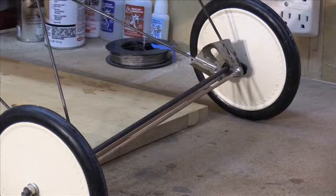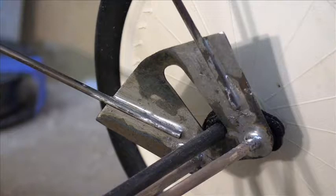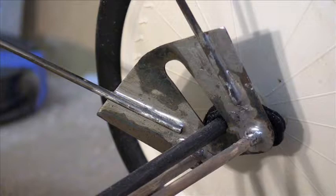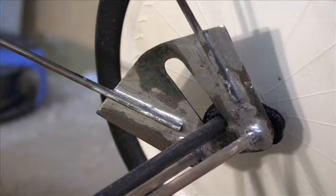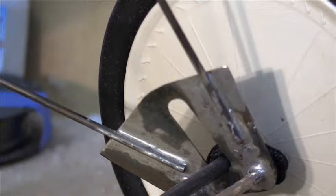Down at the bottom where the struts come together, I've used mild steel — 32 thousandths or 1/32nd inch steel — to make the guide plates. These are silver soldered to the ends of the 1/8-inch music wire struts. Later in construction, those wires will be covered over with basswood fairings about an inch wide by 3/8 of an inch thick, giving a really nice scale appearance.